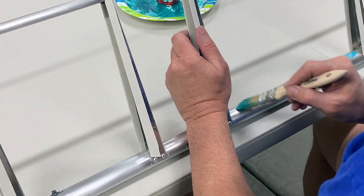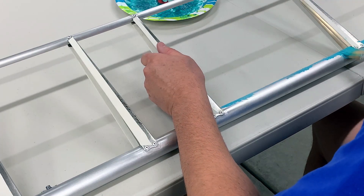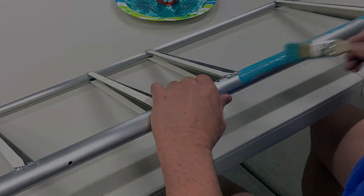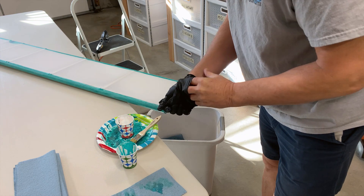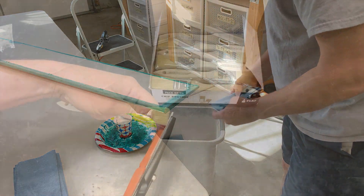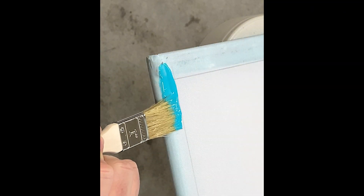After all the prep work, it's then time to brush on the glue and let it dry, making sure to apply plenty of glue without too much of a mess. Not that I'm a fan of buying any actual tools at Harbor Freight, especially for use on aircraft, but I discovered these cheap brushes to use for the glue, which I could then throw away after each use. Cleaning a single brush each time was just not worth the effort. But because there were still plenty of loose bristles, these still needed trimming, as I needed to produce a solid edge when applying the reinforcement tapes.